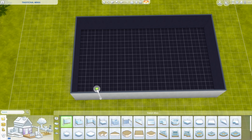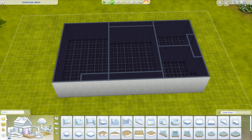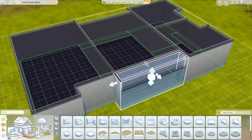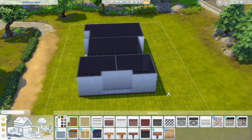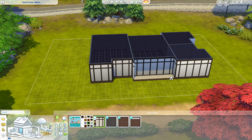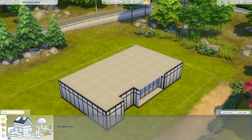We're going to start with the traditional Japanese minka. Just like every other traditional building, the minka is a wood timber frame structure, and it sits on a foundation type called soseki, which are stones laid in a bed of stone or gravel, on which the columns of the building sit freely — as in, they're not fastened. The only thing holding this building down is gravity.